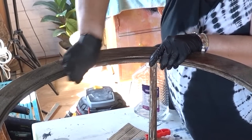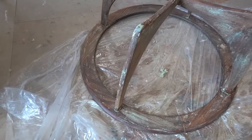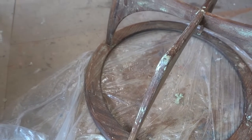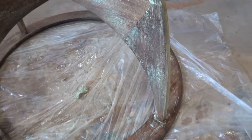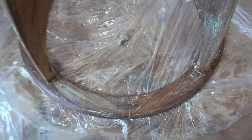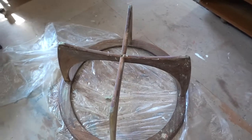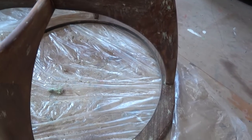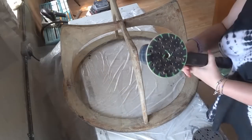So now that we've gone over it with the stripper and the mineral spirits, this is as good as we're going to get it, and now we're going to need to sand to remove what's left. Luckily, this is a solid wood piece, so it has capacity for us to sand quite a lot. But if this was a veneered piece, then it would be a lot more tricky.